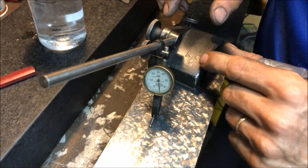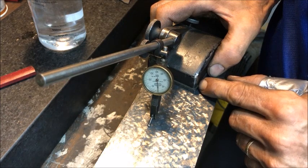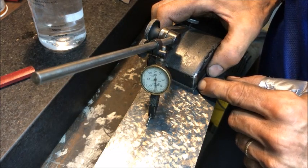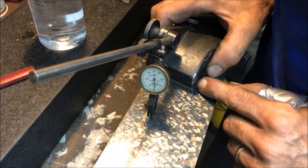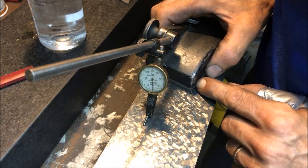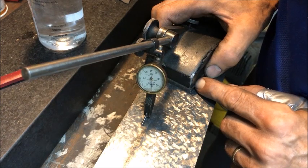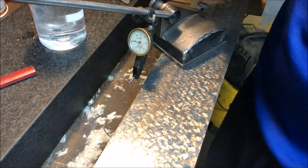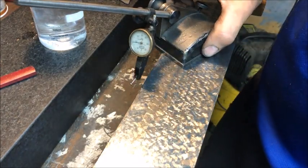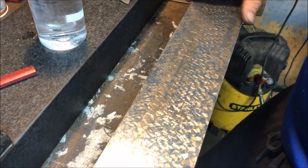Call that zero at the high spot, and gently move it down the valley here — one hundredths of a millimeter — it's four tenths. So that's one hundredths of a millimeter maximum deviation there. And the rest is within at least half, and along the length.